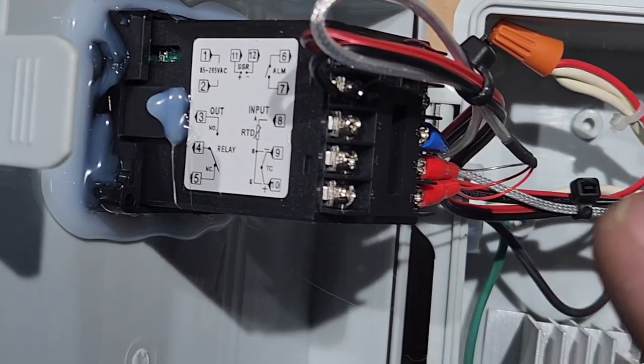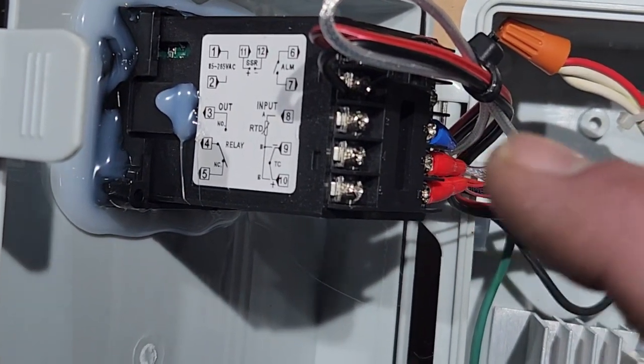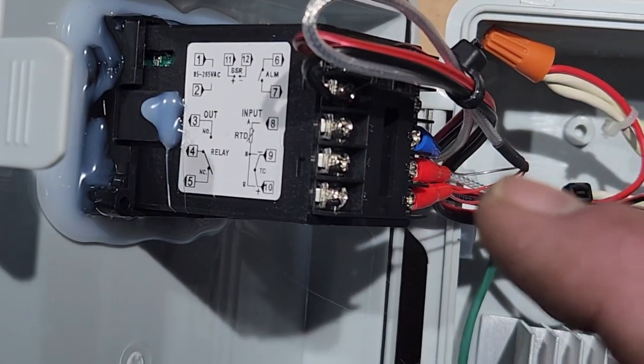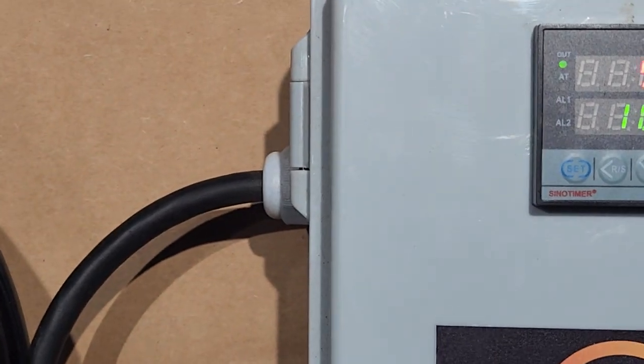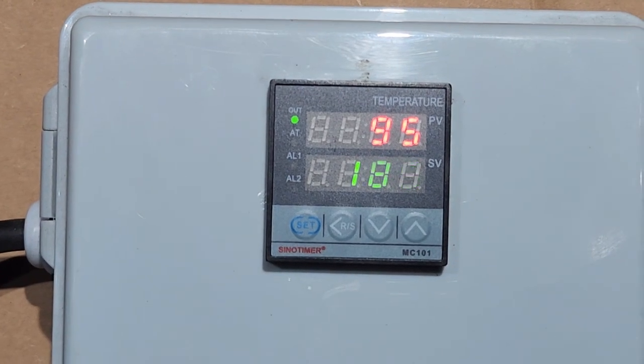If opening and closing the box has broken one of those lines, turn the box off, pull the wires out, cut them back to fresh clean metal, re-insert them under the screw terminals, and tighten securely. That also fixes a broken wire issue. This usually happens because the wrong thermocouple type was selected or a wire was broken from repeatedly opening and shutting the box.